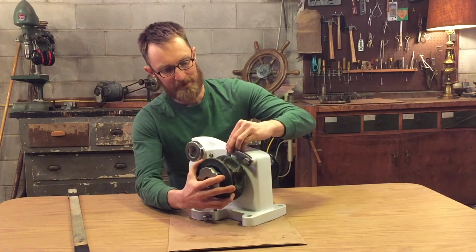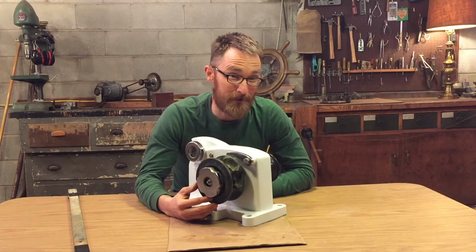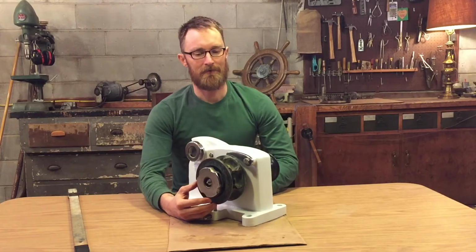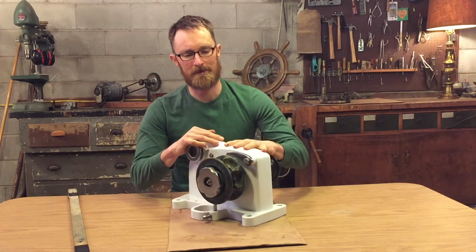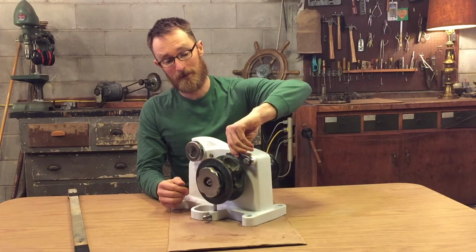Lock it in place with a pawl, and then it's always wise, I think, if you're going to leave the boat for any length of time, to have a snubber or a bridle taking the load rather than the windlass itself. Now when you're ready to pick the anchor back up, same thing goes.